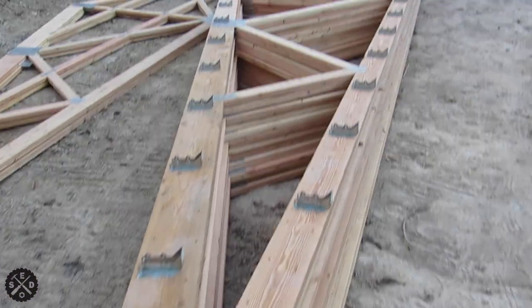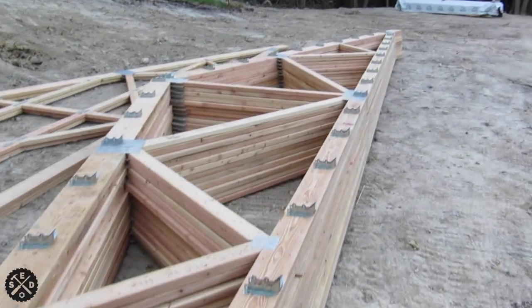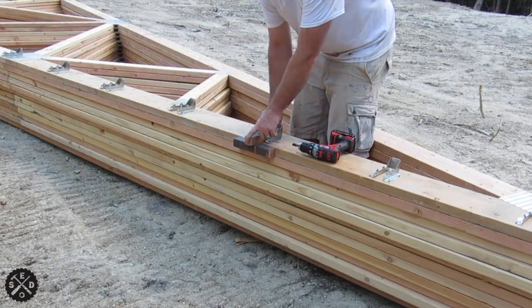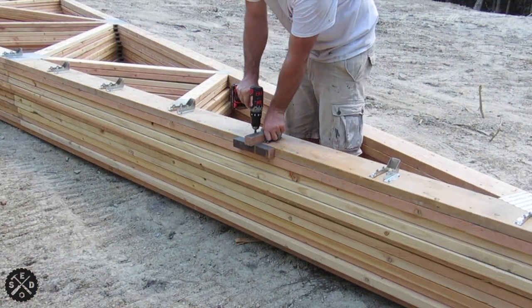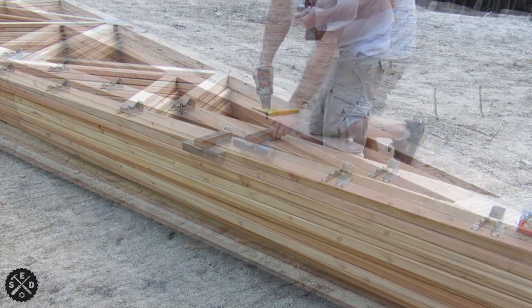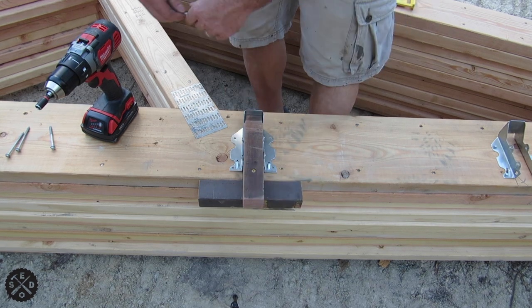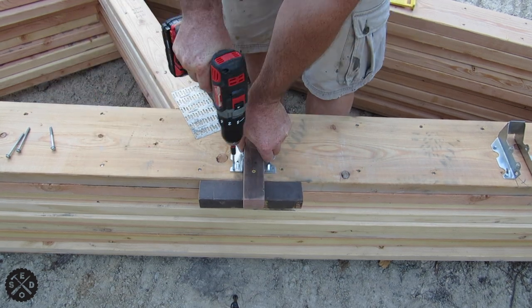That's just a little trick that I found. I put joist hangers on the top and the bottom in my particular application on the trusses here, and it worked really well for both. You just set it there and it squares itself. All you have to do is do a layout — like two foot on center, whatever you want — hold it there, make sure it doesn't move, drive your screws in, and it works really good.